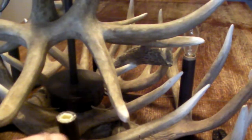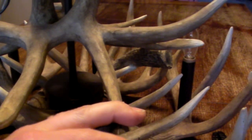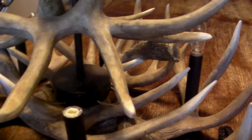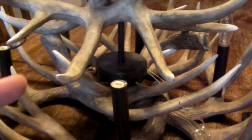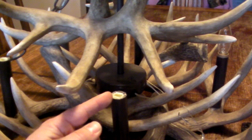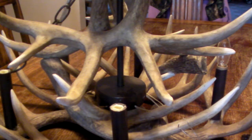The reason I'm doing this is because I don't want to invert my power. This bulb here takes 25 watts. Even if I went to a fluorescent or a smaller LED at 120 volts, I'm still going to be using more power with the 110/120 volt system. There are 6 lights around here, which were a total of 150 watts with the standard incandescents. The 194 bulbs I will be purchasing consume one half of one watt each, making it a total of 3 watts power consumption.